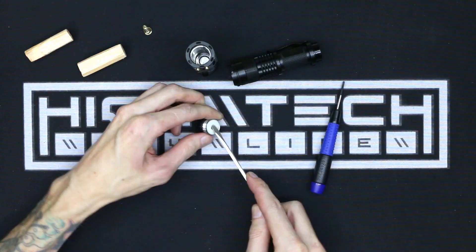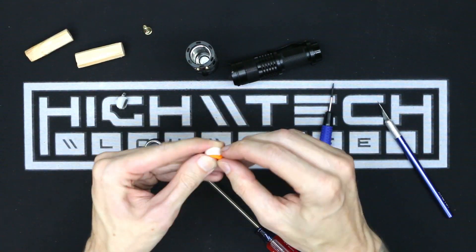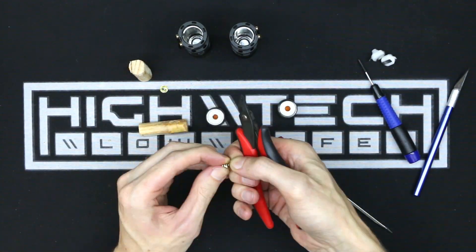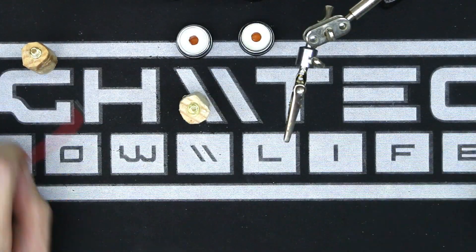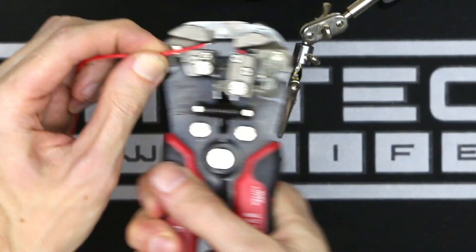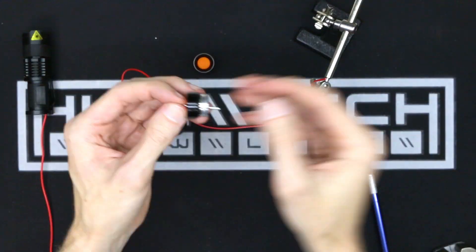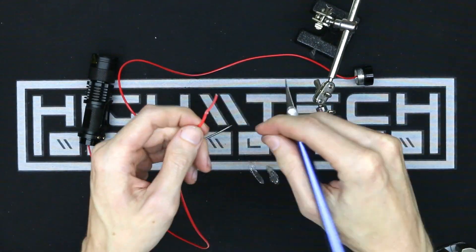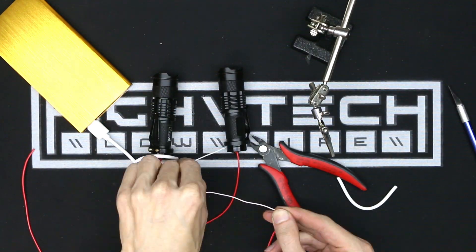The dowels that I lathed are to act much like a battery and provide pressure onto the LED in the front. Unfortunately I could not get these to work. I'll totally take the blame for it not working, but I do not understand why, because it is very simple — it's just two wires powering ground. I got one to flicker just slightly, but still nothing consistent. Maybe it's because I fed them 5 volts instead of the 3.7 that they were expecting and maybe it overloaded something. These flashlights were also very cheap, which might be a reason why they didn't work. Sometimes you have to try things and experiment and fail, and that is totally okay. If you're not afraid to break things, you're going to learn a lot more quickly. This isn't even the only lighting system you're going to see me break in this series. It doesn't work, so we're moving on.